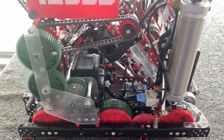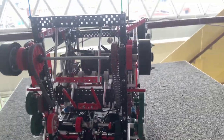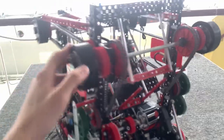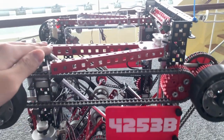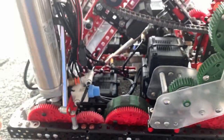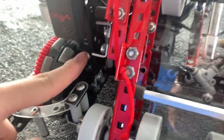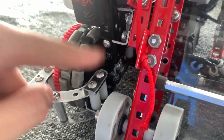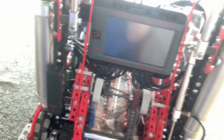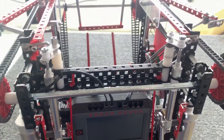Next, I'll quickly talk about the robot structure above the drivetrain. Almost every single thing on this robot is actually just mounted onto these four pieces, which provide the main structure of the robot above. To mount these pieces, I used one whole 1x1 U-channel — I cut one hole over here — and you can see they're all boxed to provide the maximum amount of structure. These just get screwed onto the U-channel going up, and then I have C-channels and L-channels constraining them on the top as well.